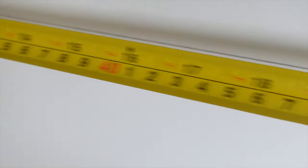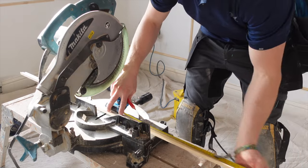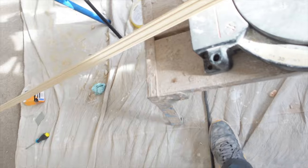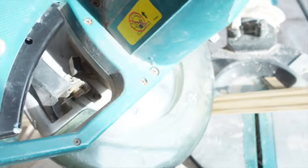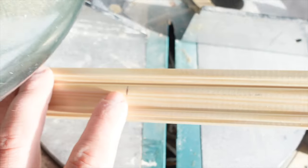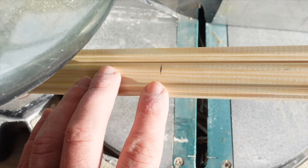I'm going to get a measurement. Now, the first cut, you want a mitre. I'm going to explain why in a bit, but it's so the corners of the room meet. We want to set the saw and put it on a 45-degree angle. We're going to mitre it so it's got a nice mitre meeting in.